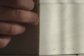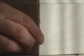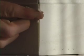I came around to the front and I worked on this a little bit more where I could see it, and I decided, after rounding it just about as much as I felt good about, as you can see, we decreased the size of it significantly. I'm going to take a little bit of my favorite filler here, and I'm going to just very lightly dab it and get that crack filled in, making sure I work that into the hole a little bit, so that when the paint goes on here, it's going to look like a real nice finished surface.